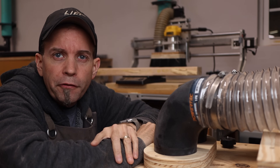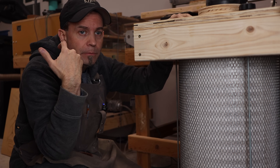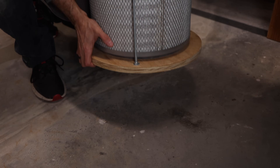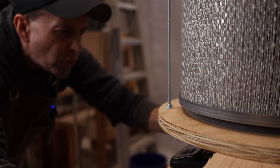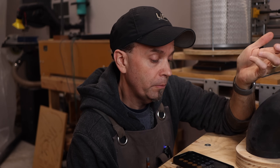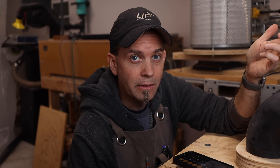38 minutes of feeding material. I'm not going to weigh what's in the canisters — I'm only going to weigh the filter to see how much made it through the system. 8,268 grams. That's 12 grams. So that's 0.012 — that's 1.2% captured, 98.8% efficient.